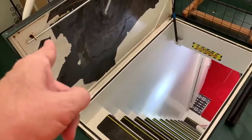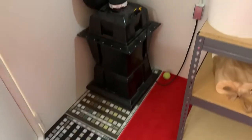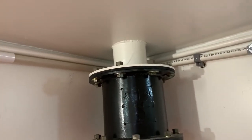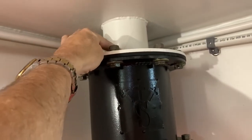The only things I can do are: change that lid to a bulletproof lid, fill the escape box full of sand, and change the air system out to a Swiss air system with a manual crank — electric and manual. My air pipes are four-inch; Rising S only has a four-inch air intake, while Atlas usually has six to eight inch. We'll cut this, put a flange on it, do an adapter for the Swiss air system, and do the same for the overpressure blast valve. His escape tunnel will have a nipple with sand filled up to there. The door has to stay because there's no room on the outside for a gas-tight door, and I can't do anything about the stairs. All I can do for the hatch is make them a brand new lid and add a good hydraulic lift to replace that Rising S plastic piston.